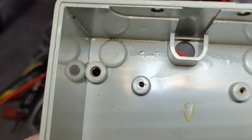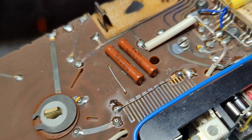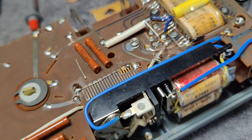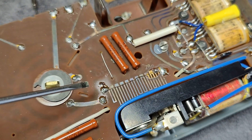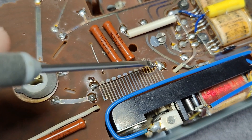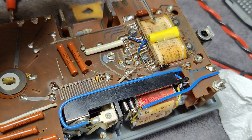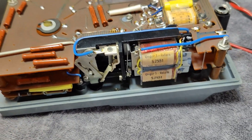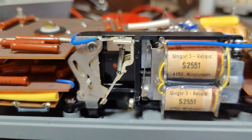Oh, look at that — what is that and where is it coming from? Something I will have to investigate. It is also slimy. But it is not from the batteries. Look at that calibration — that is obviously current, right? Why would you measure current through circuit board tracks? I mean, copper is very dependent on temperature, so this can't be good. The transformer here is of course for all the different AC levels, doing all the ratios for AC voltage, current and all that with AC. And here is the relay — the holding relay.